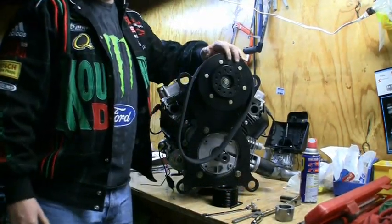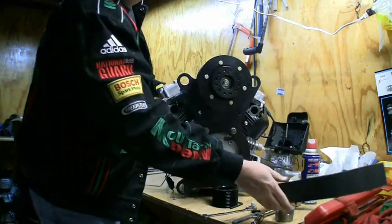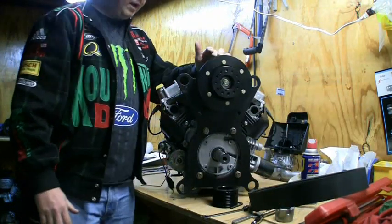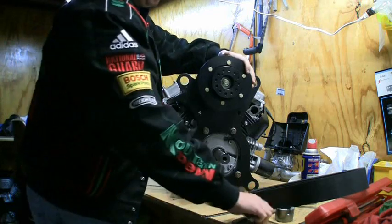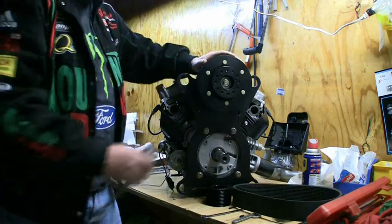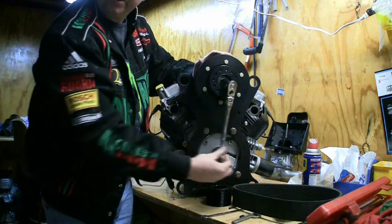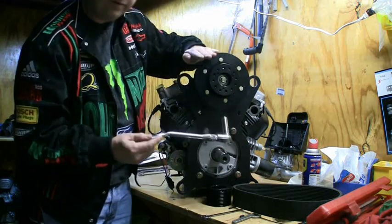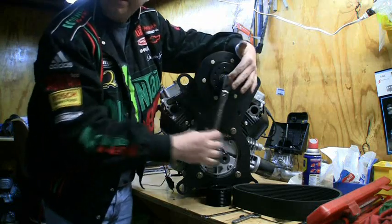As you see on the Green Eagle, this is an engine that's not mounted, and we've got it all stripped down so you can easily see the drive. The drive on a Green Eagle is an eccentric shaft drive. If you want to tighten the drive, you take a 15-millimeter socket, and as I turn this, you see how the drive goes up and down. That up and down motion is what tightens your belt.